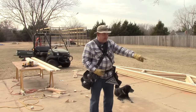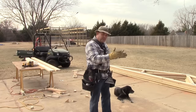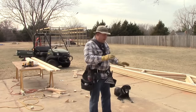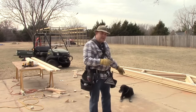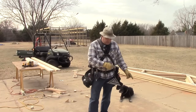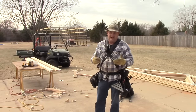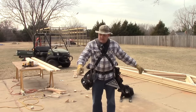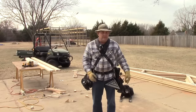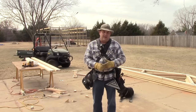Then I measured 12 feet out from each side, because my trusses are going to be 12 foot on each side, or 24-foot sidewalls, and then they hang off a little bit off the end. To get a perpendicular line, I used some high school geometry — a squared plus b squared equals c squared. What I did is I squared the 12 foot, measured up 12 foot and squared it also, then did the square root to come up with the total.